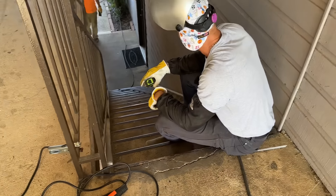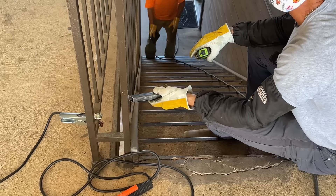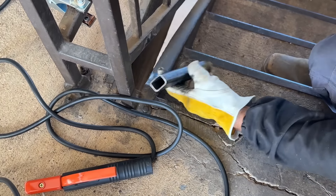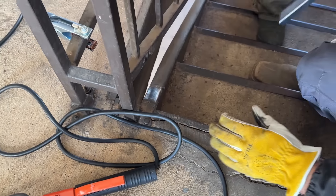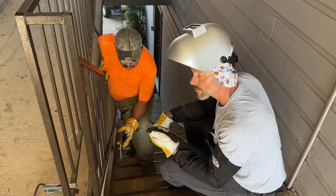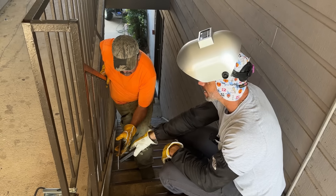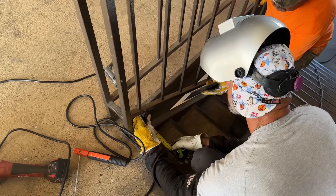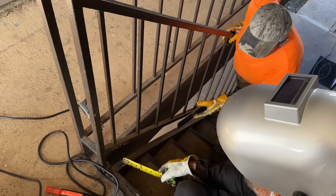Look down this rail. Remember, they used to use the plate to put in the middle — that's exactly what we're going to do. I'm going to have to weld a little piece of plate on this and then come up, because I just can't leave that. Somebody is going to come up here and say, why'd you do that? One of my favorite things to say to welders is, are you going to leave it like that? So we're going to take it over to the plasma cutter and cut us a little two and a half inch piece. We'll weld that down first and then run this up.